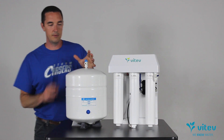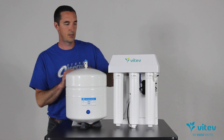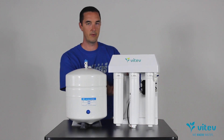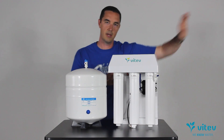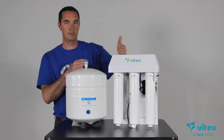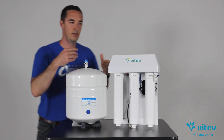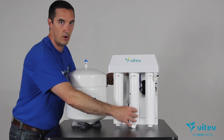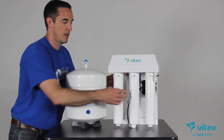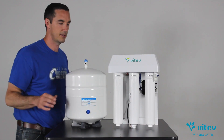Fundamentally, there's one main thing to think about when you go to troubleshooting, and that is start at the furthest point away from the supply line. Wherever your supply is coming in, right next to your pre-filtration stage, go to the other side and start there. You want to work your way from downstream to upstream, and then you can get an idea of where that volume issue, where that clog, where that restriction is taking place.